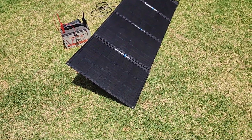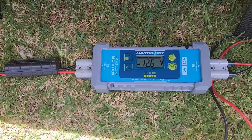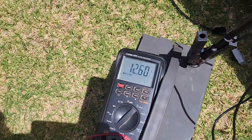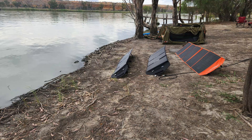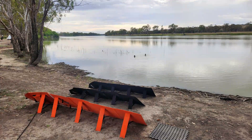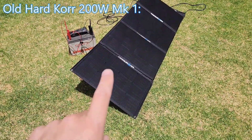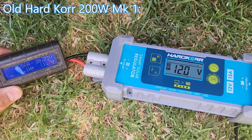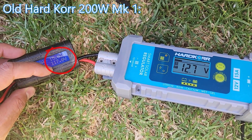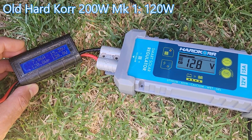For these tests, we'll be connecting our solar blankets into the cable that came from the new Hardcore blanket, then through our power meter, into the new Hardcore PWM regulator which is unchanged from the old model, through the alligator clips, and into an old AGM battery currently at about 12.6V. I've tested these two Hardcores alongside my old 300W iTech World blanket under a few different conditions on a few different occasions over about three months and gotten pretty well the same sort of results. We're going to start with the old Hardcore blanket as a baseline — conditions are clear and sunny today. We got a stable 120 Watts from the old Hardcore blanket.